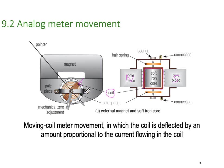Here's the wire coil. You can see a very, very small air gap. That's that bit in there that I'm pointing at. And then connected to that is a pointer. The pointer is actually connected to this shaft. So this shaft running through the iron core and the coil are all connected, and you've got the needle pointer connected to the shaft.